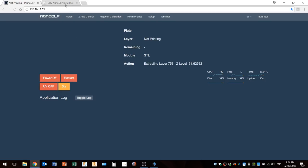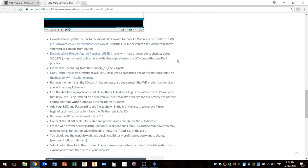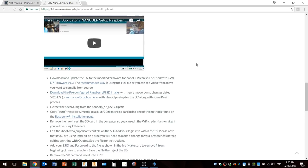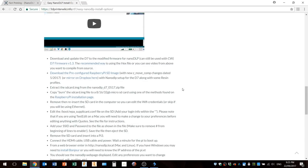So one of the things I want to talk about early on here is that you really need to get compatible firmware for the Duplicator 7 and the Raspberry Pi image. So they both need to be compatible. And what I discovered in my journey of trying to get NanoDLP set up was that this firmware and this image work together. Other combinations that I tried did not, and it was very, very frustrating. It's worthwhile watching the videos on this page. I'll put a link in the description to this page, but mark my words, this is the easiest way to get going with NanoDLP.